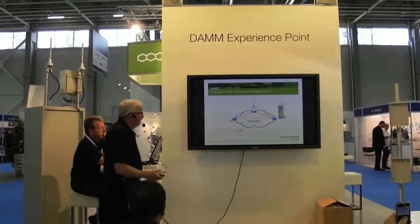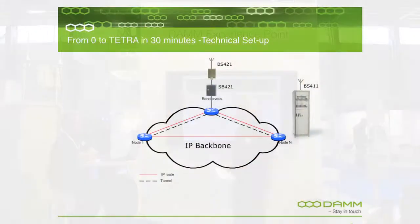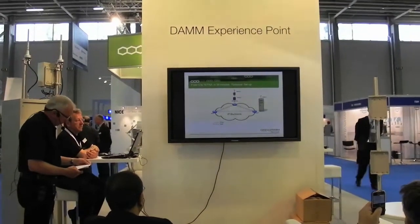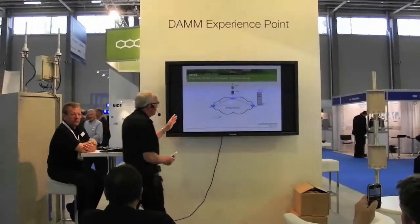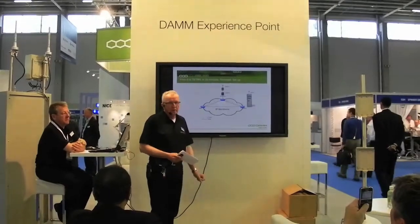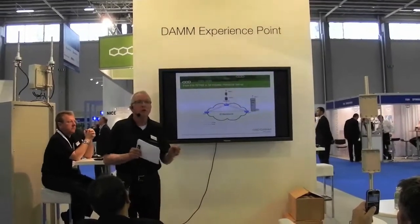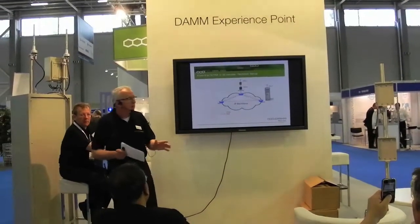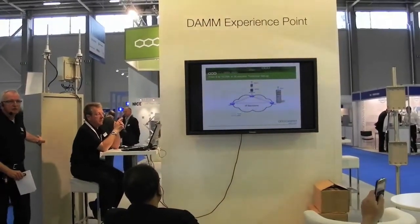The second base station is standing behind here. It's our outdoor base station — a 400 MHz base station with one carrier and an output power of 10 watts. Be aware that we are using only pure IP technology at DAM. This means we are not using central switches or central nodes. We do not have a single point of failure, because all of our software and all the subscribers are in a register in every base station.